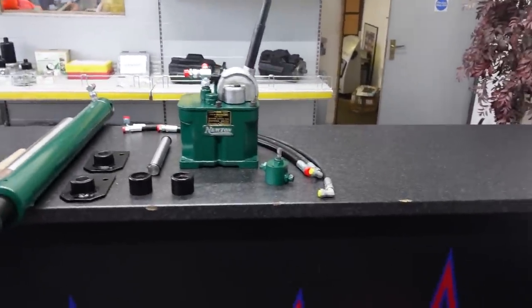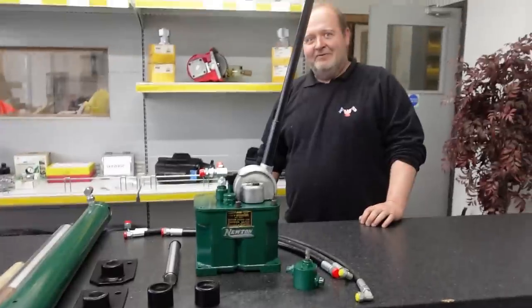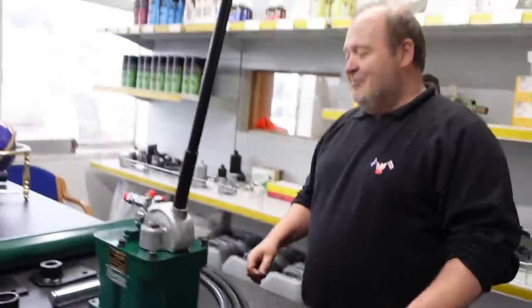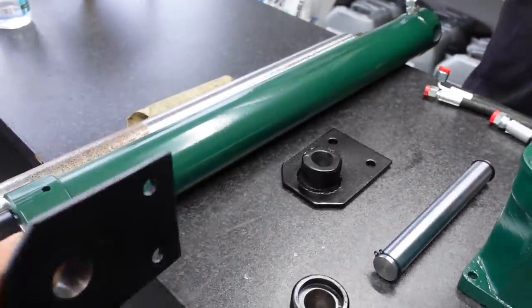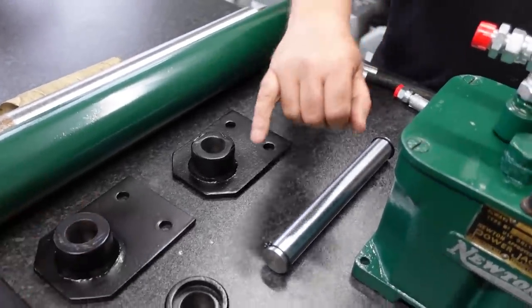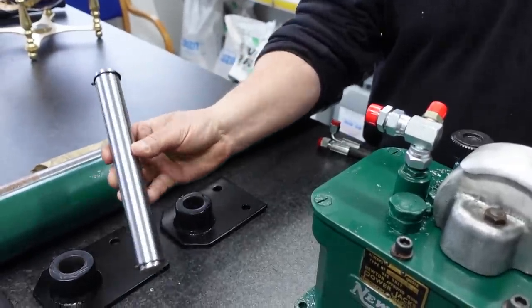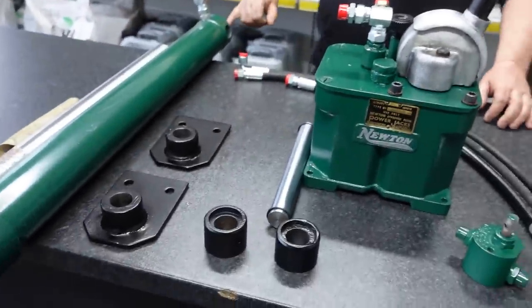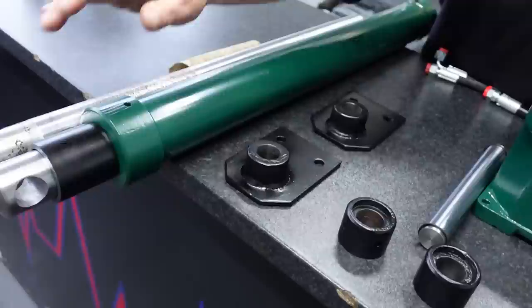Hello Glen! Oh my god, look at that - here he is, the man himself. We thought we'd clean it up a wee bit for you. Honestly, oh it's beautiful - you're showing me up now with the rest of the crane! We managed to get these for you and we've made a new pin. These are the original bits - they go in the bottom and hold the base of the ram on, but they were all seized. We got these off, you've got your new pin, and it slots in with these. We also put a grease nipple on the bottom so you can now grease that pin. Perfect!